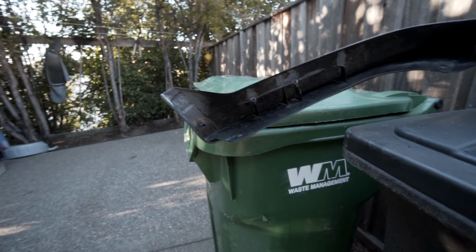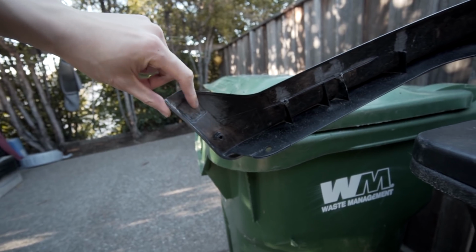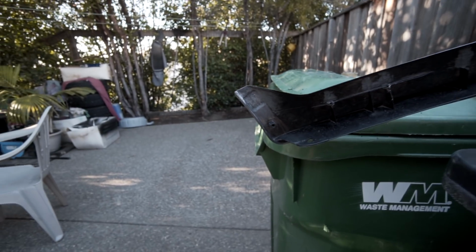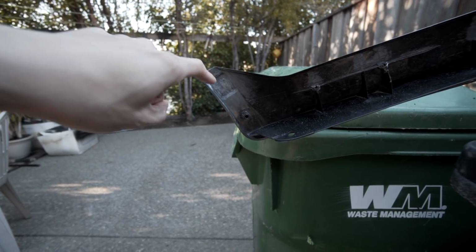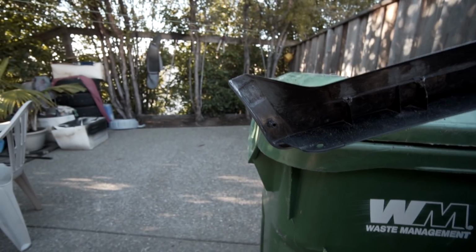Here's the lip right now, and I've been spending the past 3 hours or so carefully dremeling and sanding down this corner right here on the back side of the lip on both sides. So what I'm basically doing is beveling and insetting a rectangular shape here. That's because originally up here there was just a stub, and that wasn't a very secure mounting point, and I didn't really feel comfortable about that.